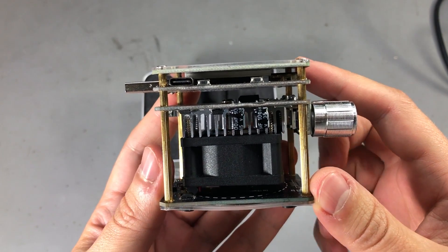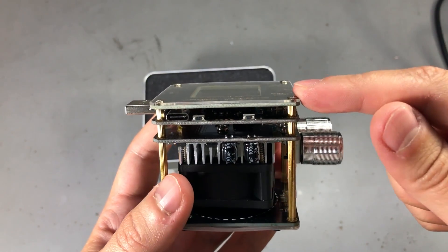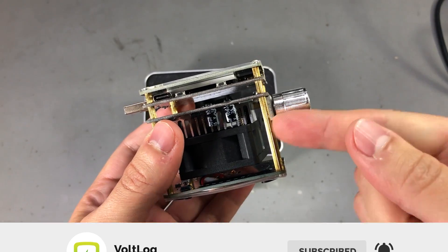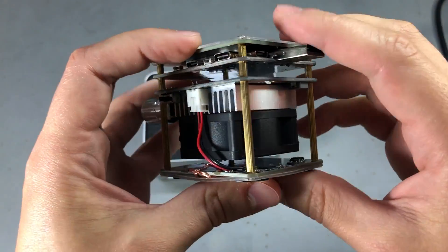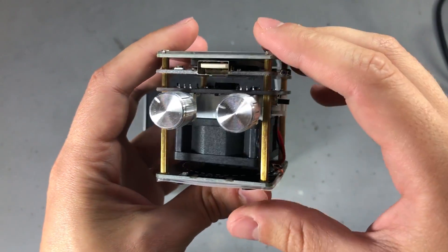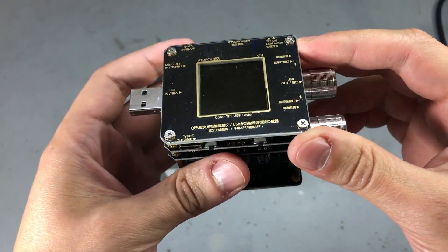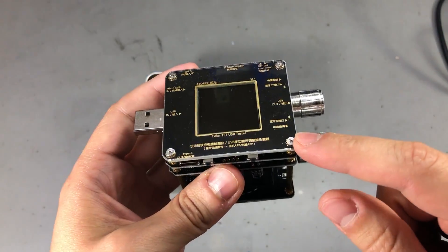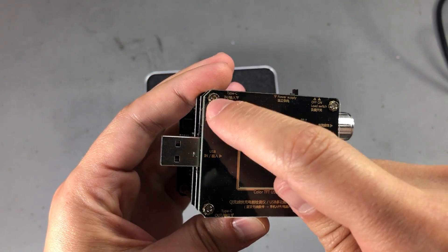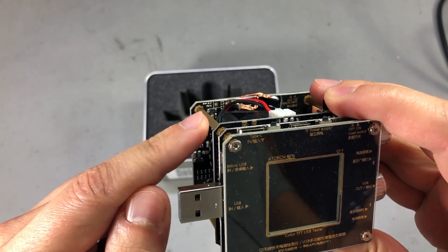This load is built with 3 active PCBs as well as a 4th passive front panel. They are joined with brass standoffs and I think the standoffs act as circuit pads as well because there are no wires between the different levels. In order to get the alignment right during assembly, the designer made the corners on one side rounded while the ones on the other side are diagonally cut, and you can see these features along an entire side.